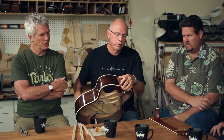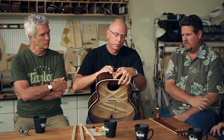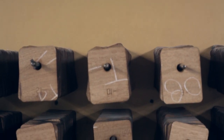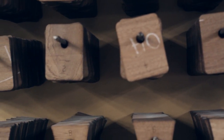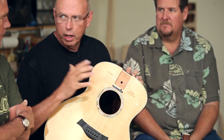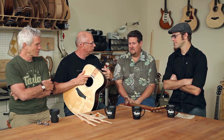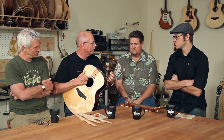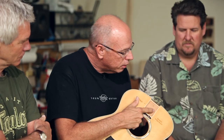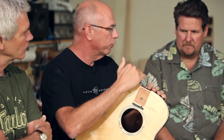When you see a Taylor guitar, it's hard to imagine that the neck is actually inlaid right here and right there, because it looks like any other traditional guitar. But underneath it is these little — we call them shims. We've glued these in place so that they don't fall out when we demonstrate it. It's a stunt guitar. This is a shim and this is a shim. Shims in the guitar world have a bad connotation — it sounds like you missed. But shims in the machinist world, in the automotive world, are a precision instrument to bring something right into the spot it's supposed to be. These are precision made. This one has lasered into it a zero — that's its value, meaning there's no angle on it.